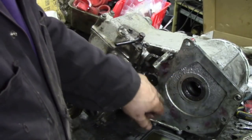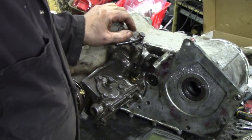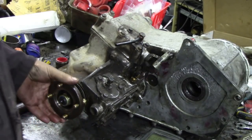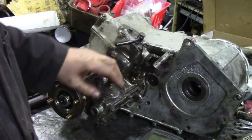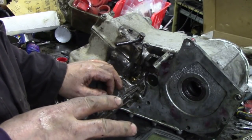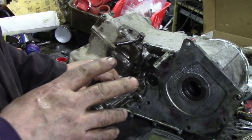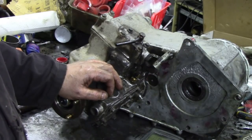We can't put any oil in this one so we're going to cover it with a no-oil sticker. So all we've done - we haven't really overhauled anything apart from changing the gear in here. But I hope it's shown you that you can't just change the gear and put the old shim in. It's best if you work it out and calculate what the shim is.